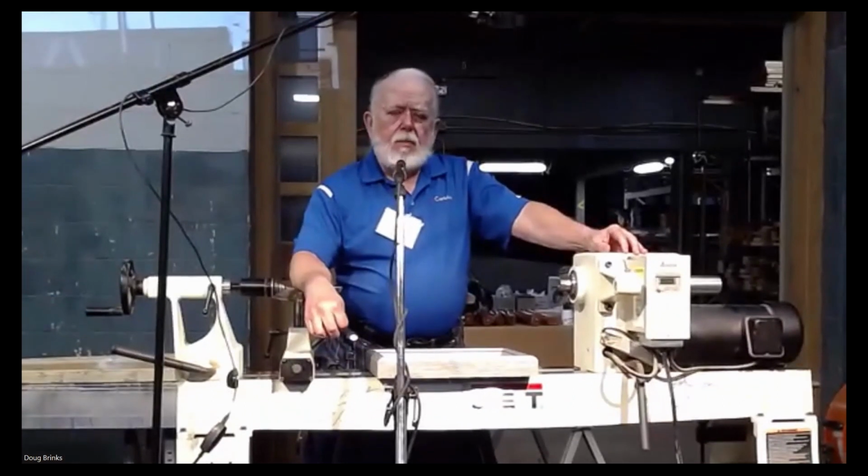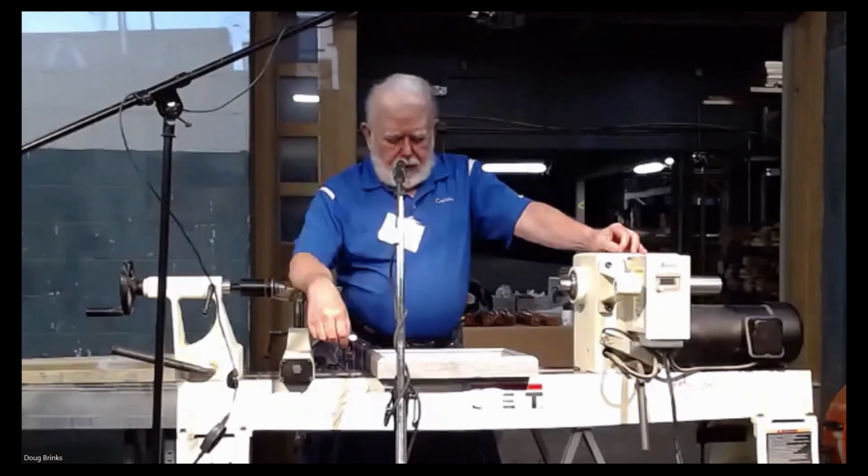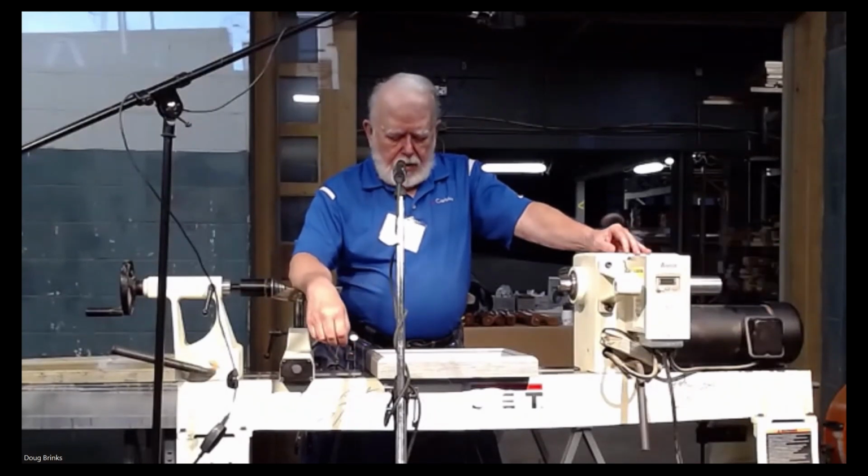It's important to put that edge on. It's similar to putting an edge on a knife with stropping. And you'll see that real small edge on a knife. It's highly reflective and highly polished. That's what we're doing with these. Our angle of cut on the flat tops is between 25 and 27 degrees. It's all calculated out. It's something we've been working with.